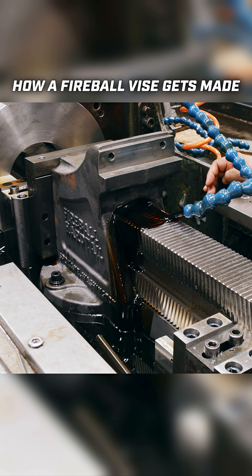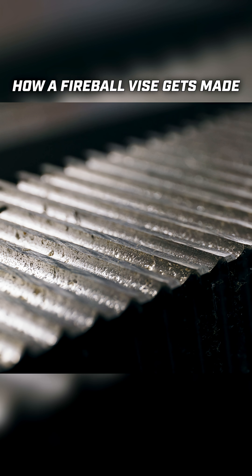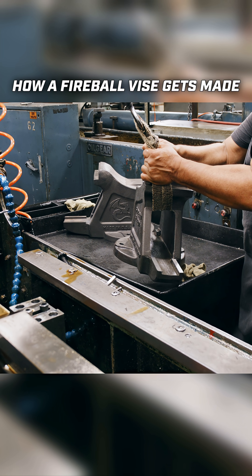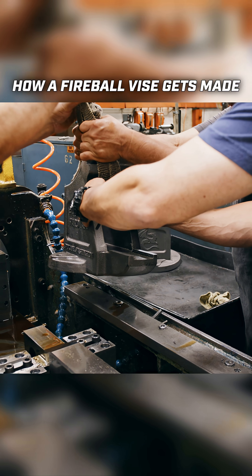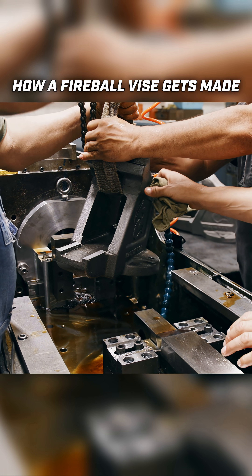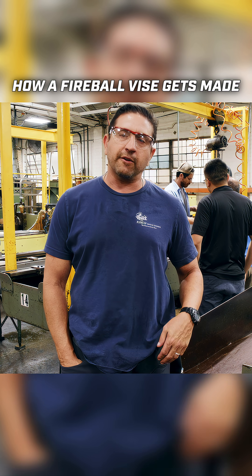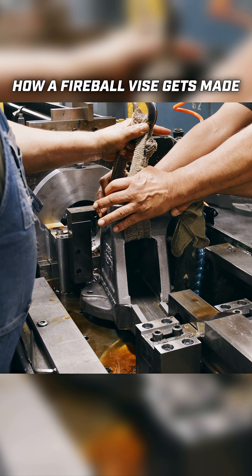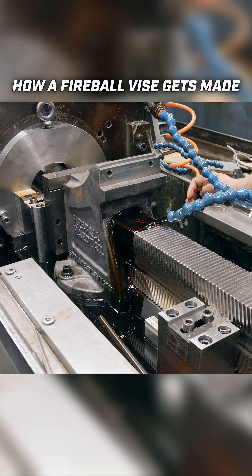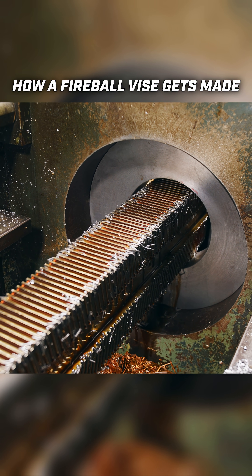A broach is a tapered metal cutting tool. It's made out of PM-M4, 67 Rockwell. The broach tool itself is made within two-tenths tolerance and can hold accuracy within a thousandth. This is an extremely unique application — it's starting from an existing geometry. The broach isn't actually generating the shape; it's shaving out from an existing form. In manufacturing the broach, we had to start from the lowest possible dimensional feature so the broach could get into the hole, and then it shaves out to the finished geometry.